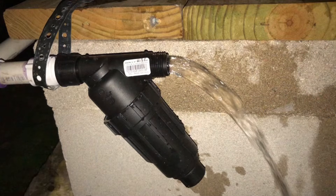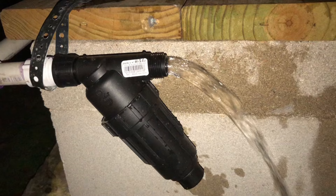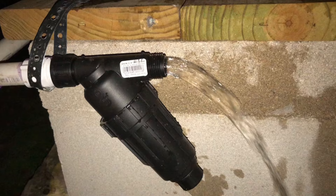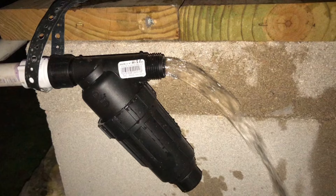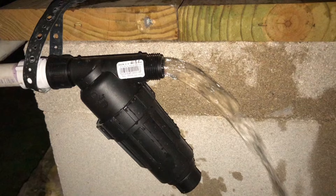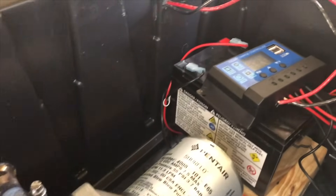When using a water pump, one important thing not to forget is to have an inline filter hooked up before your pump. I have a garden hose that runs about three feet from this filter to the input of the pump. If you need a small hose like that, it's called a leader hose — they do have them at Home Depot in the garden section. Once you connect the hose from your rain barrel system to the back of this box, you're ready to do a test and make sure it works.